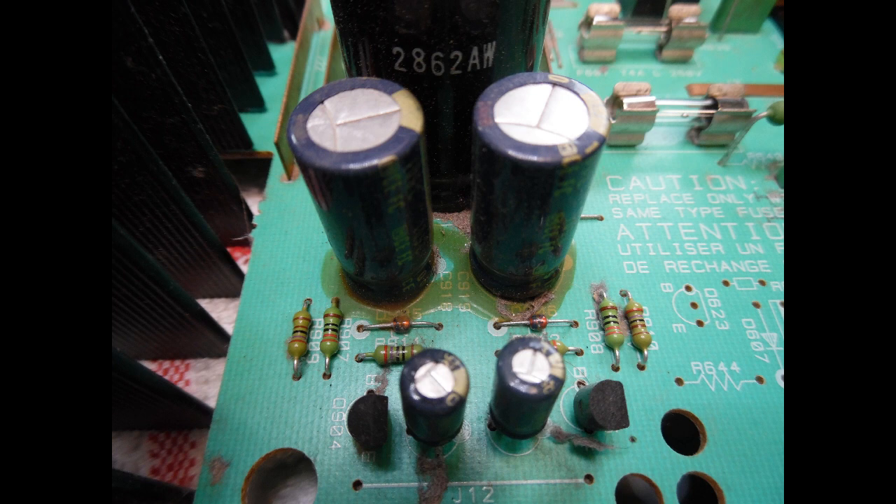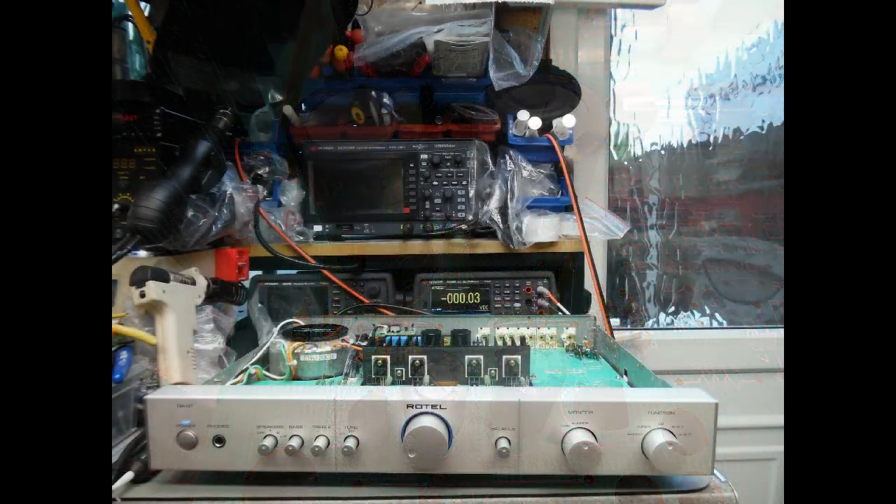Just make sure the low voltage power supply has no issues. Then, as with many of these repairs, just leave it on test for a period of time — hook your scope up if you want, put in a sine wave, and just make sure everything is good.